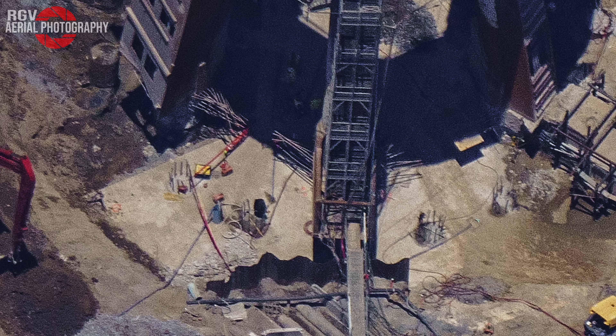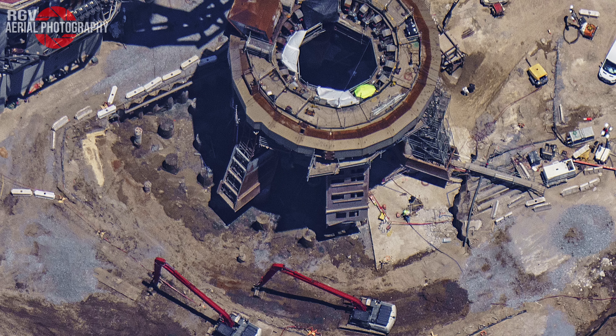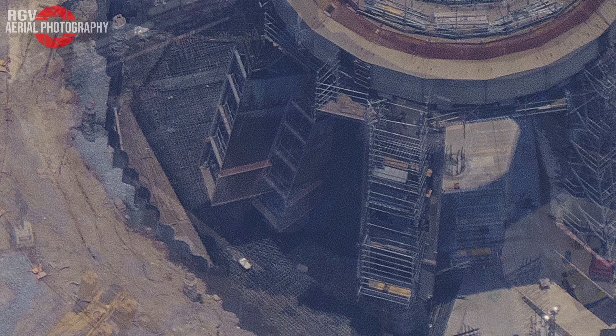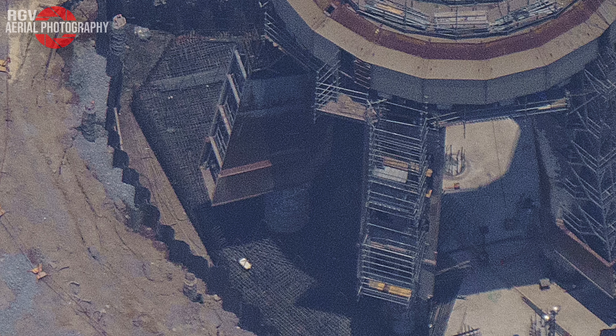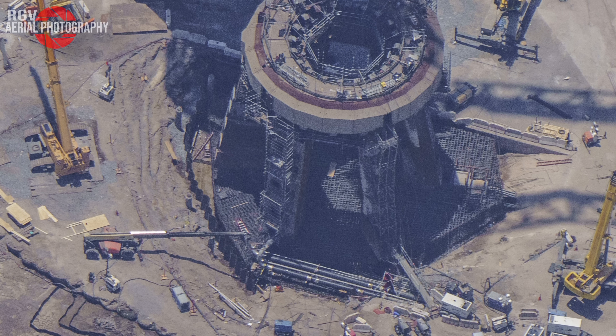With the concrete piles cropped down to the proper level, the first half of the blinding layer was set. This concrete base covers the north side of the base structure and also the entire surface under the launch mount. We aren't sure whether or not they ever completed the remainder of this blinding layer, or if they went straight into laying down rebar on the south side of the structure. The density of these layers of rebar makes it nearly impossible to tell whether or not there is concrete underneath. Moving ahead to the present week, we can finally see the full shape of the pile cap.